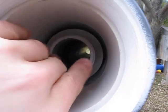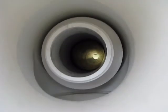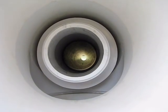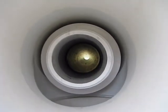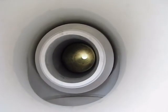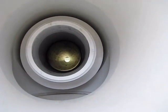It's probably pretty hard to see from the angle, but down below leads to the air chamber. You might think there's not enough room for all that air to run through there — like it might be limiting it. But really, all you need around the circumference of your outlet diameter is about an extra quarter inch. I have almost an inch all the way around that, so there's plenty of room for the air to come out — it's not inhibited in any way.